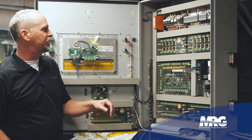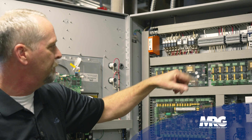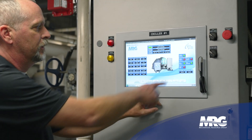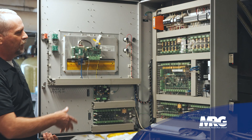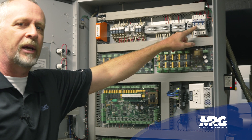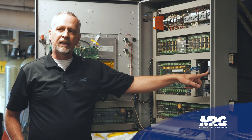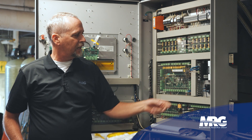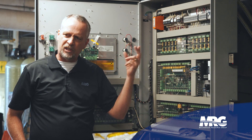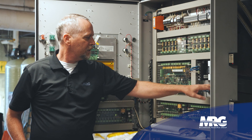Inside the panel we've got a lot of circuit boards. Up here are the relays that give LED indications — I've got a run status showing the machine is running and the purge is on. That same feature was reflected in the compressor overview screen. With the cabinet open you can just look and see what's energized. They also give you dedicated circuit breakers for the oil heater and oil pump. There's a GFI outlet ready to go in case you need to plug in a laptop, Cat5 connections, and BMS outputs for alarm status and close contacts to report back to your BMS — machine running, machine in alarm, water flow, and so on.